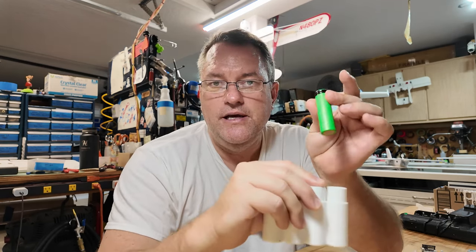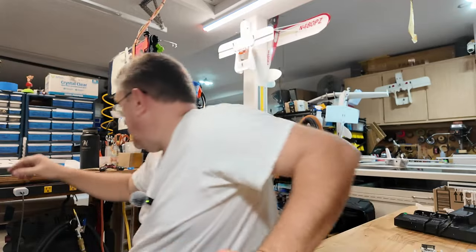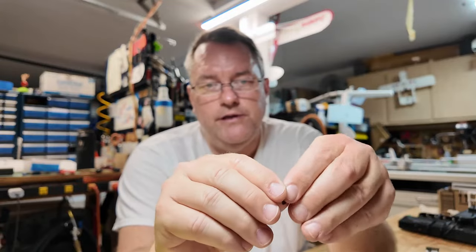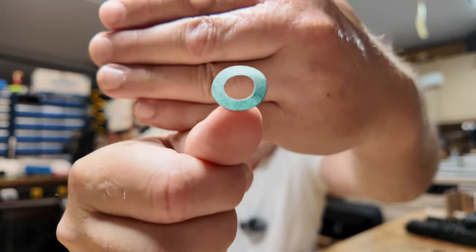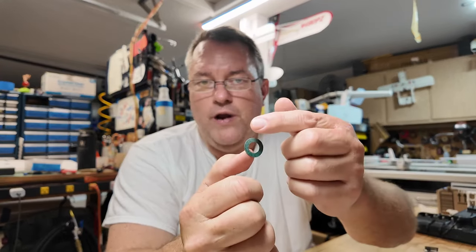When you buy these, it's easy to damage the heat shrink case. You can find pre-cut shrink wrap for 18650s online — it's plenty cheap to buy. When you buy that, it also comes with these cap pieces that go on top of the battery. They're pre-cut and insulate the very top of the battery, keeping the case — which is the negative side — and the button top — which is the positive side — separated. When any connection is brushing over that it doesn't temporarily short out your battery. These are just paper cutouts, but they work really well — it's how the batteries are manufactured.